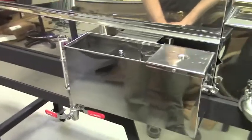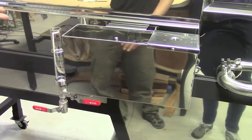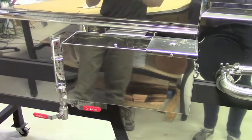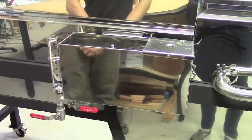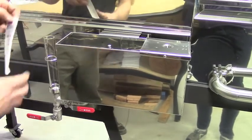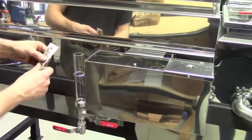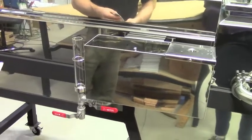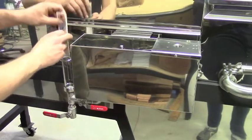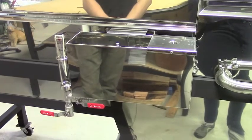And what's this on the side here? That is the sight glass. That allows you to see the liquid level in your pans without having to look into the steam and try to decipher what's going on with the raging boil. It gives you a nice, even view of what's going on in the pan. This is the scale — it's not on the glass at the moment; it's up to the operator to put that on once they get their evaporator set and leveled out. So it kind of confirms what the float box is doing — it gives you peace of mind and allows you to make the adjustments with your float box very accurately.